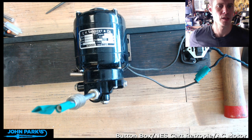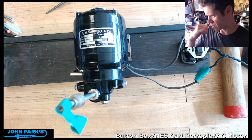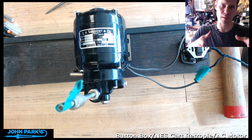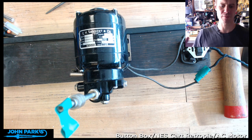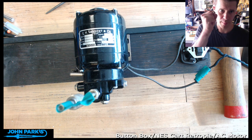So yeah, Jan Bridges, you were asking what do you do with an AC motor that only runs at 4 RPM? It's pretty torquey. So originally it was like moving a big stir plate or something like that for a piece of medical or chemistry equipment. I was thinking about using it for moving, either sliding a drawer out in an escape room box or raising a pedestal. I may use a linear actuator now for that. So this one, you can, but definitely with like timing belt attached to it and something clipped on it, you can slide pretty heavy or high friction stuff because it's really, really torquey. It's hard to stop. You can barely seize it up with your hand.